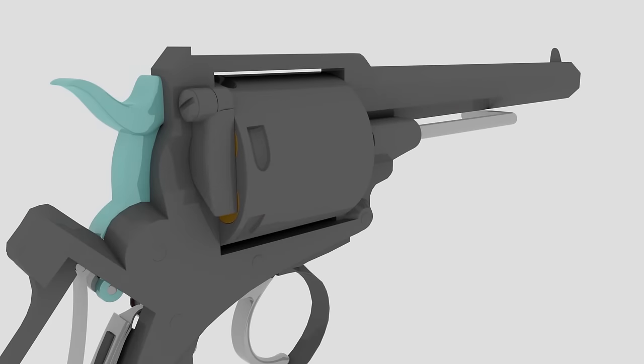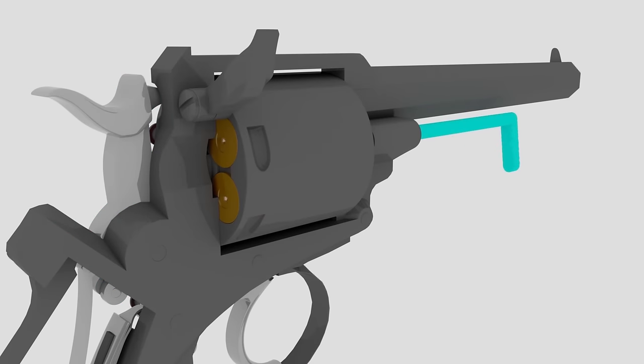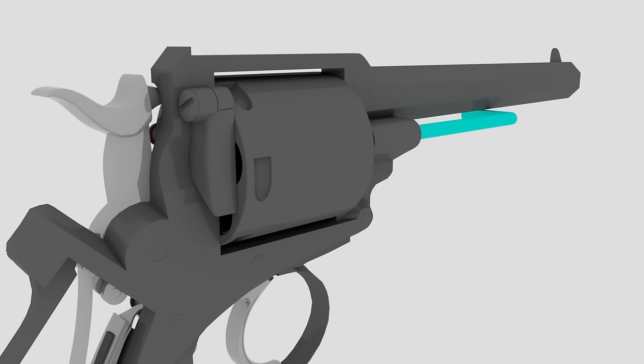To unload, we'll first rebound the hammer again and open the gate. Just rotate the ejector 90 degrees, freeing it from its detented position, and manually snap it back to eject each casing. Once more, there is no spring assist. We must push and pull all on our own. Once she's empty, close it up and rotate the rod.